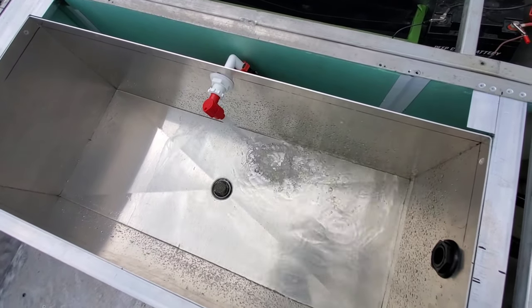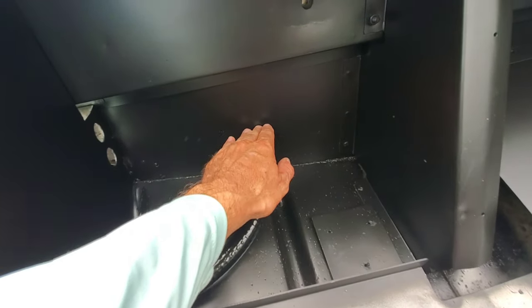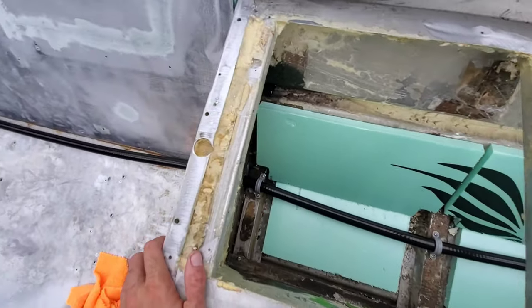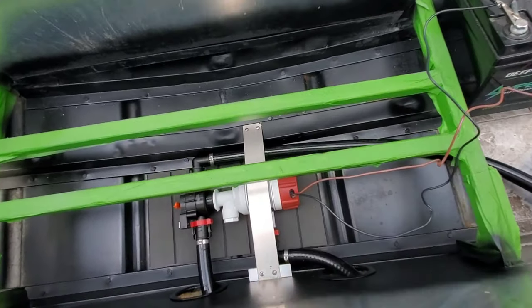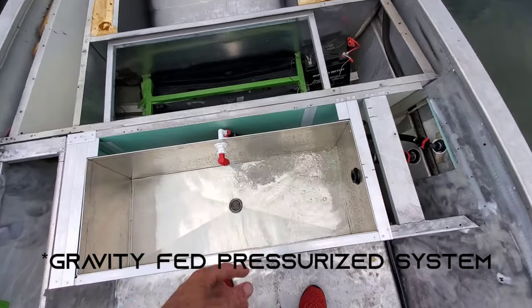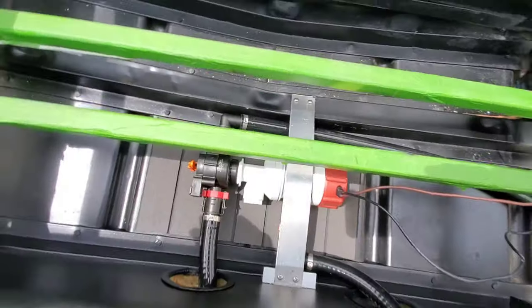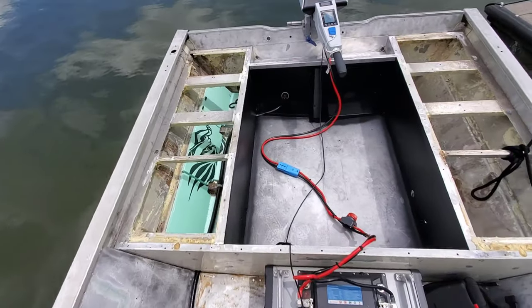There it goes — and now it's full force. This fitting is below the waterline, so water is just coming through the hose, filling that air cavity, actually filling it a little bit uphill, and then downhill to the pump. All the pump is doing right now is maintaining suction — and it's filling the livewell. As you can see, it's working fine. What's awesome about the Flow Right is the quick connects — nothing is leaking and everything is working as planned.